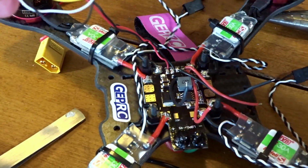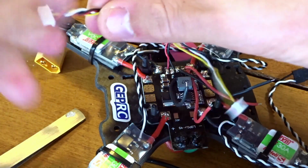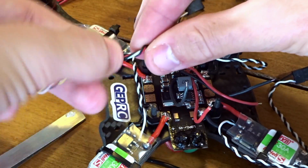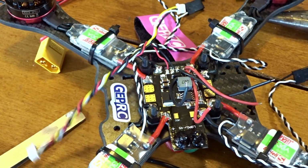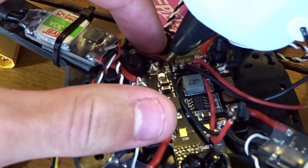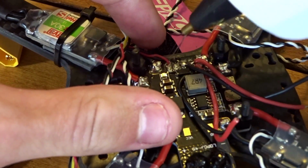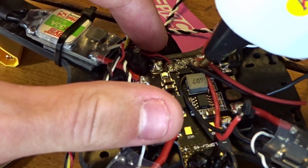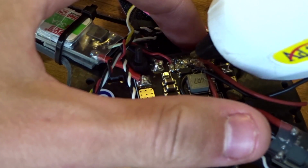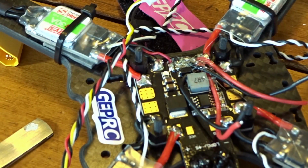So now we can rewind this cable back up, just for keeping things neat for right now while the hot glue is heating. Right there, it's wound up enough, so hot glue should be ready in a second. I'm hitting the base where the connectors attach, and then a little bit of the wire and board around them to make sure they're really held in place well and don't wiggle and vibrate around so they can't break off. There we go. Now let's let that dry and move on.